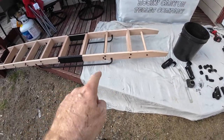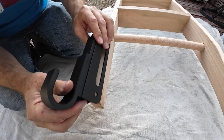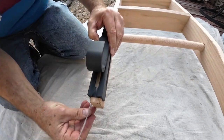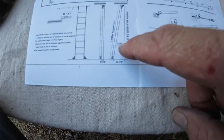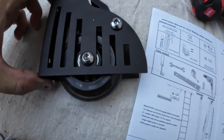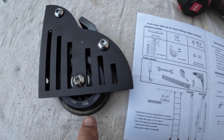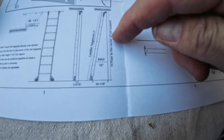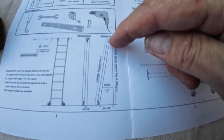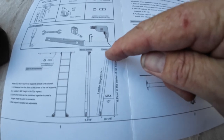Don't forget to put your hardware on the correct side. The downside is the climbing side; the other side is where the hooks go, and there's a tapered part — the hooks are just the perfect fit, no shims needed. When setting up where to put your rails, measure the height of your ladder plus one inch. That one inch comes from the wheel mount being flush with the bottom of the ladder — one inch from the bottom of the bracket to the bottom of the wheel. My ladder is 107.5 inches so the center of my rail will be at 108.5 inches.